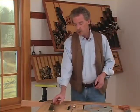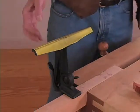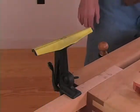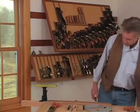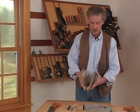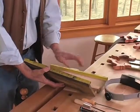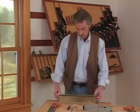To start with, you need a way to hold the saw. This is an antique saw vise — there are lots of different styles that were made and available. This is approximately the right size for a dovetail saw, but it's not really very convenient for sharpening a longer saw like a tenon saw, and definitely inconvenient for a panel saw. So what I like to do is make my own saw vise, which is quite easy. This is one we use in the saw shop every day. It's two pieces of plywood hinged together with leather, with spacers nailed on, so you can hold the saw blade. It goes right in the vise on your bench or a metal vise, whatever you might have.